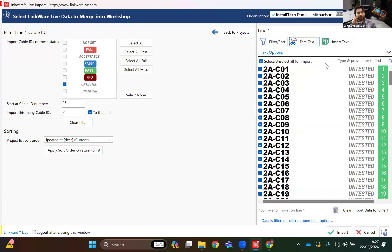Alex explains the trim function further. You might have extra information on a cable label such as floor, room, and rack details, which you'd need for identification in a cable tray or cable run. But once you're in front of the patch panel, you already know that information. So you might trim off the location prefixes and just keep the port number. For large data centres where cable IDs can be over 50 characters, that information won't fit on a patch panel, so trimming to just the relevant port designation makes practical sense.